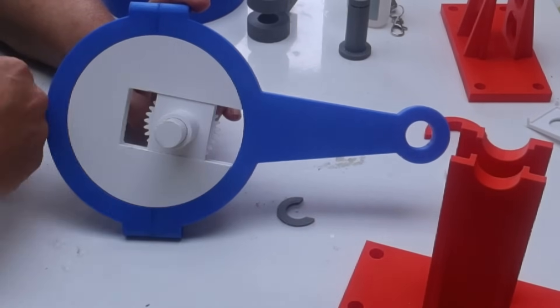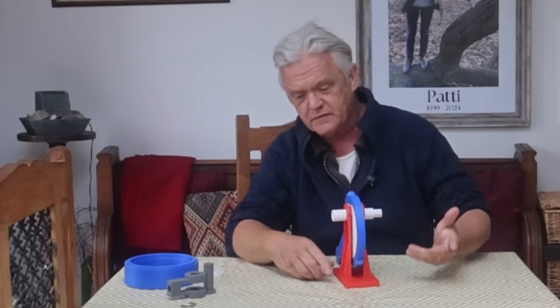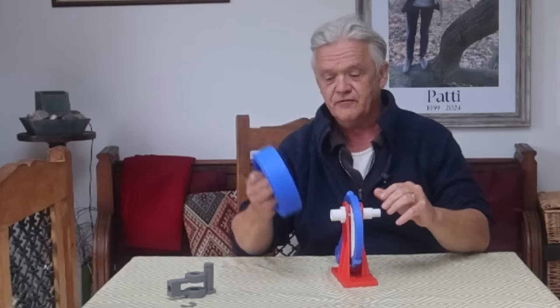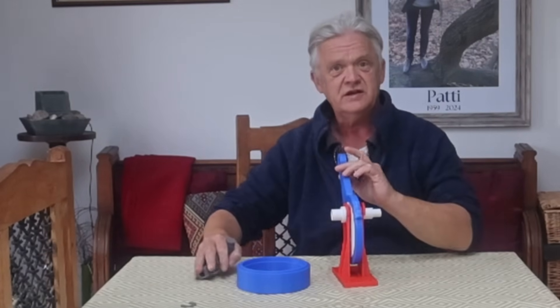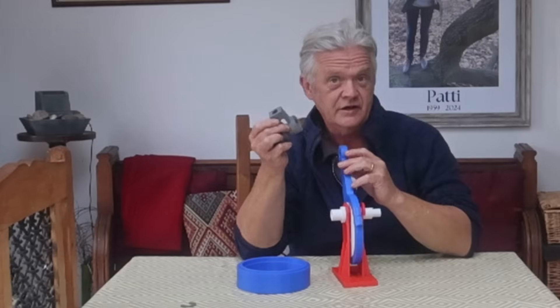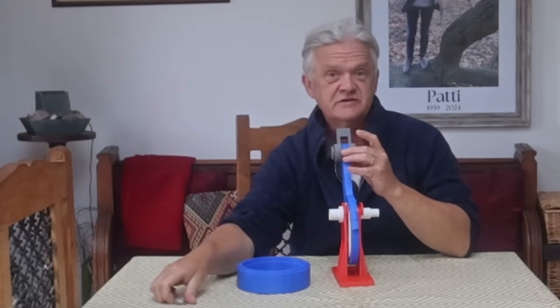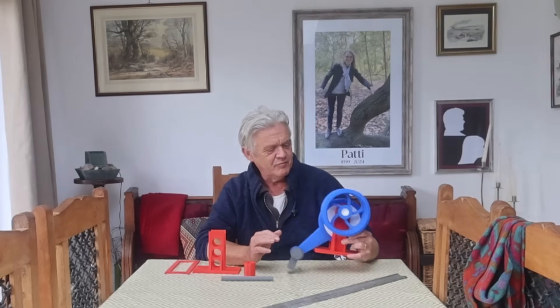Now we can put it into the cradle — and there it is in the cradle. We have a couple of caps and a bit sticking out. That faces inward and glues on there, with another one gluing on the back, so it's like that. Once you've got it like that, there's a spacer ring that goes on that side, and then the flywheel goes on there — that'll be quite tight to force on. And on this end, we've got the actual articulation for the piston itself. That goes in there, the pin goes through, and there's a clip to hold it in place. That's that bit finished.